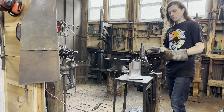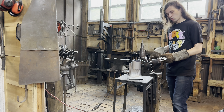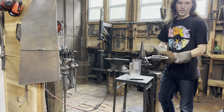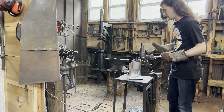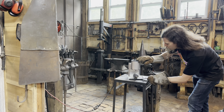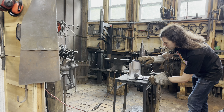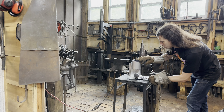Now that we're back over here in the shop and we've got our mold preheated — a very, very important step — because if your mold's cold, when you try to pour hot lead into it, the mold is instantaneously going to turn all that hot lead into cold lead and you won't be able to pour it down the hole. So I've got our mold preheated here, I just did this on top of the stove, and I've got our lead nice and melted. We're going to put this right underneath the little hole and pour our lead into the mold, filling it up until it starts to come out through the top. Do it nice and steady, one smooth go. Almost full — there we go.